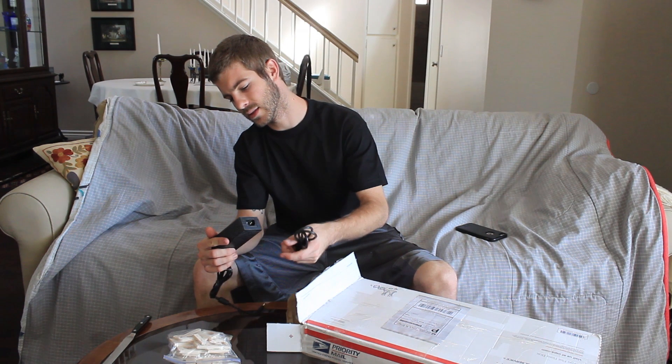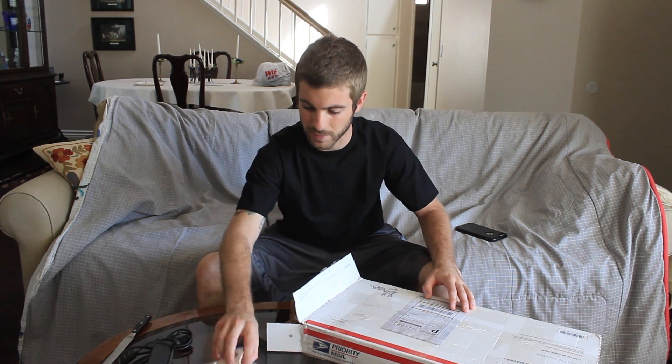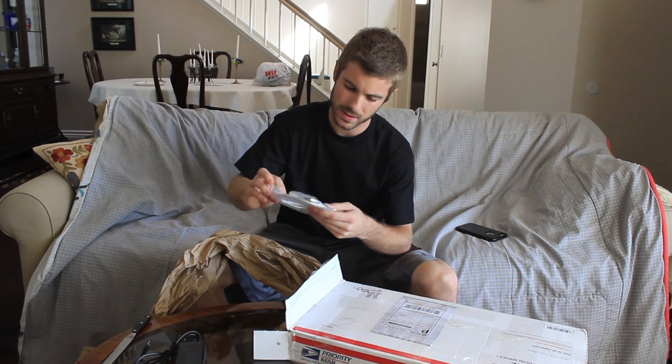We've got an AC/DC adapter — it's a 102 watt, 12 volt power adapter for the board, which I'm 99% sure is a RAMPS board. The reason 102 watts is enough is because this particular unit does not use a heated bed, which does mean you'll be limited in terms of filament — PLA will be primarily what you can print with. For me personally, I have two printers with heated beds and PLA is what I print with 99% of the time, so it's not a big deal. That's why you get to use this instead of the big 200 watt power supply you normally see with RepRap style printer kits. We've also got a USB cable, just your standard 3D printer USB cable.